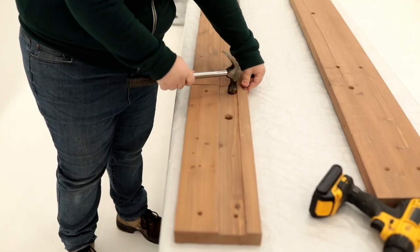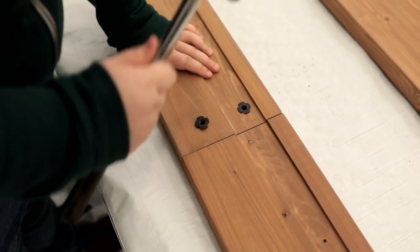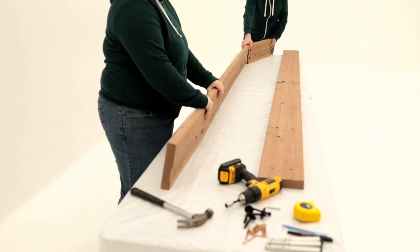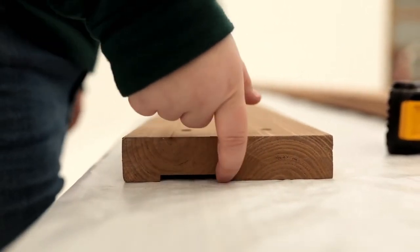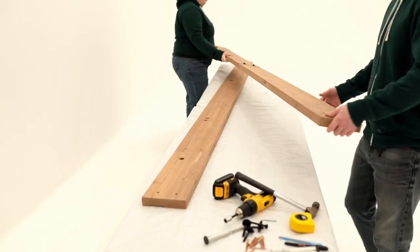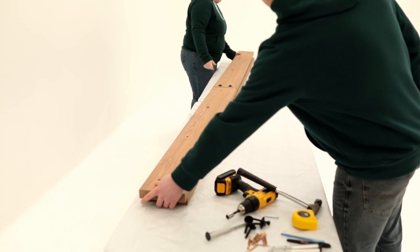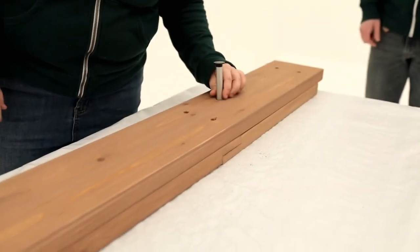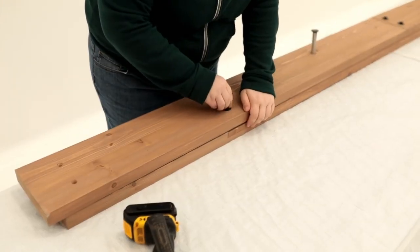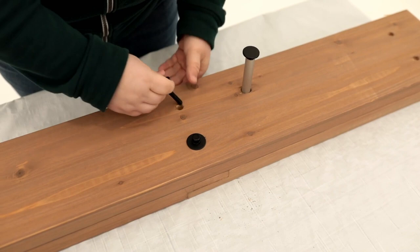Install two T-nuts into the right short beam and left short beam, then flip the assembly over so the T-nuts are facing down. The groove in the boards should be facing down and towards the bottom. Place the outside beam assembly B on top with the hex bolts facing out. Using three long pins, make sure the holes align and loosely attach the 2.5-inch bolts in the top holes and the 2 3/4 bolts in the bottom holes.